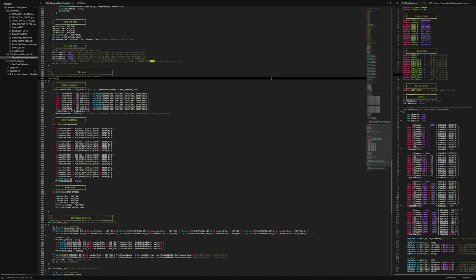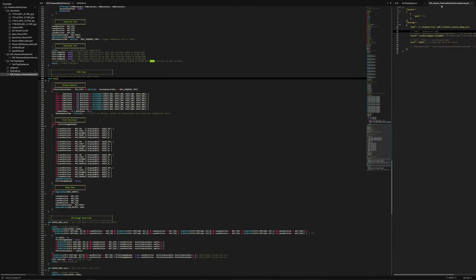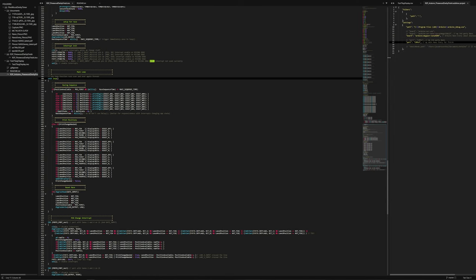I guess some other important information is that I am using Sublime Text to do all of this, and I am using Arduino CLI, I think is what it's called, for the packages, which just allows me to say what path for all the libraries, what board I'm using, which also took a bit of digging. For the Arduino Nano Every, I had to use Board Manager to install the package, and then it's Mega AVR and Nano 4809, and then the COM port. If you clone the Git repository, all of this should be in there.